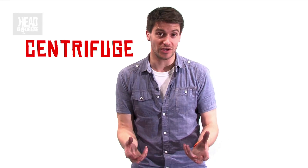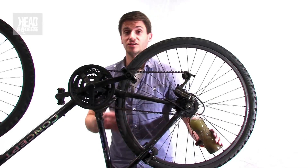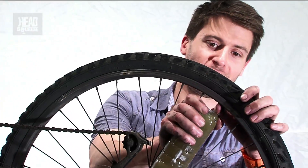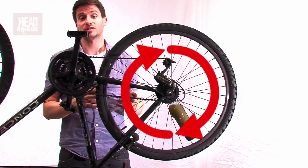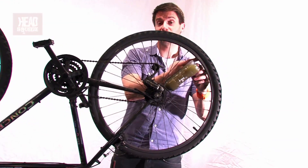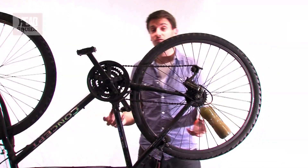There's a really clever piece of kit on ships called fuel separators, which use an engineering principle called a centrifuge. We're going to replicate that right here right now. The way a centrifuge works is we're going to get this spinning round on our wheel. When we've got that spinning, the centripetal forces are going to accelerate our mix out towards the end of the bottle, but they're going to accelerate the different components of our fuel at different rates.